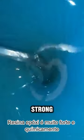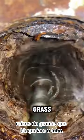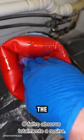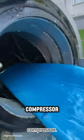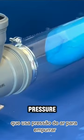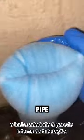Epoxy resin is very strong and chemically resistant. It's also a good choice to prevent tree or grass roots from blocking the pipe. Once the felt fully absorbs the resin, the team smooths the liner and puts it in a compressor. The compressor uses air pressure to push the liner into the old pipe, where it inflates and sticks to the pipe walls.